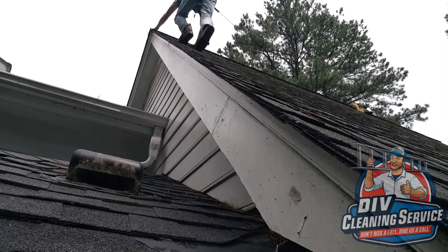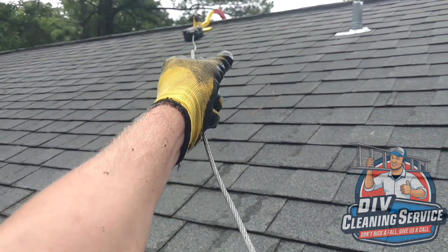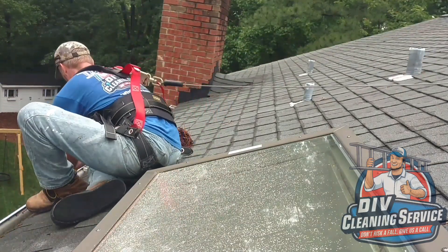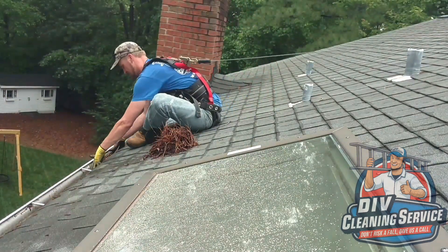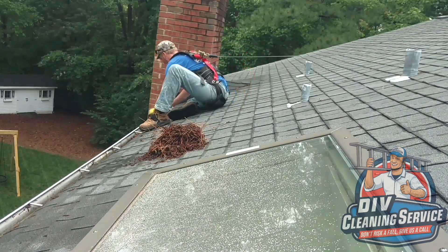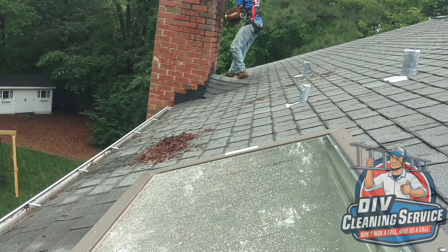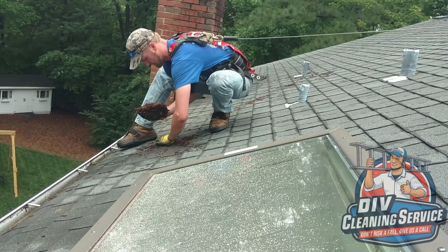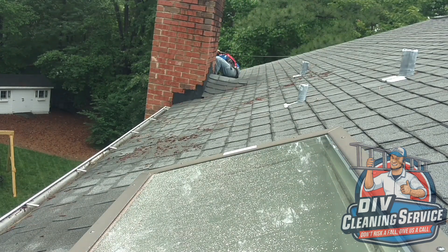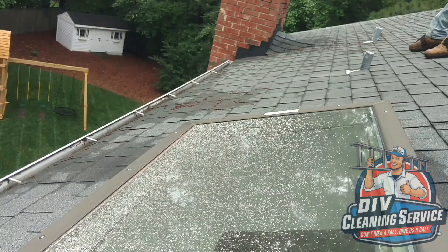When I walk up and down a roof, I try to grab onto the rake — the edge of the shingles — so if I slip, I have something to hang on to. You can see that the automatic lanyard locks up after about a foot of sharp movement. Below this section of gutter is a deck with plants and patio furniture, so I put the debris on the roof, walked around, and tossed it over the edge so nothing would drip onto the deck and make a big mess. I have to blow off this roof anyway, so it doesn't create any additional mess.